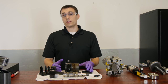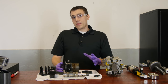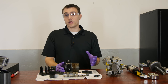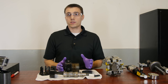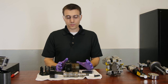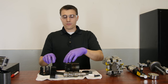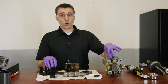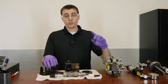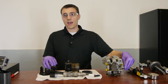Your third major failure mode is loss of power — you move your controls and the machine is not going or it's weak. If you begin experiencing loss of power, don't keep driving that machine. What could be a smaller issue will quickly become a bigger issue because when you have loss of power, you're generally going to end up with contaminants in your system — little metal shavings or filings — and it could destroy everything really quickly. Stop, bring it in, and have it repaired. Loss of power is generally on the high-pressure side: you could have scoring or ridging in your rotor group, a broken link — though that's very rare — or some scoring or wear in the head of your pump letting oil bypass. Also check this first: make sure your bypass is closed. Somebody could have opened it to move the mower and now you think it's failed when really there's nothing wrong.